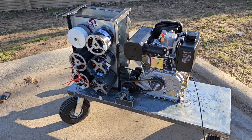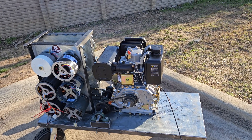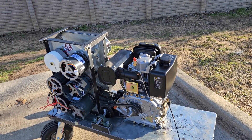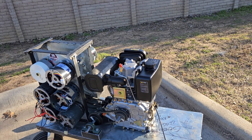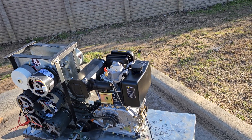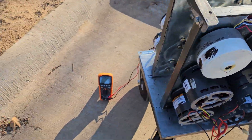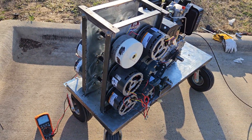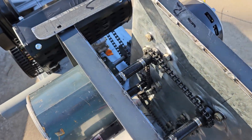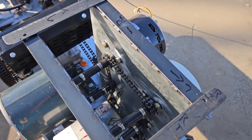All right, it won't die. It's idling pretty low there — it barely stays running, it'll die. Go ahead and kill it. All right, now I can actually look at it for a minute. Yeah, a couple screws came out — the set screws. I need to heat them up or put some carb cleaner in there and then loctite them.